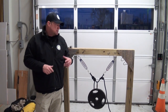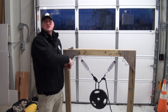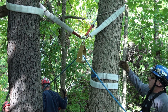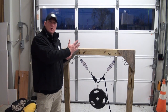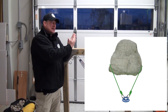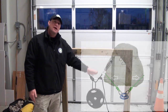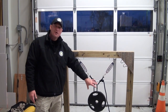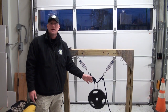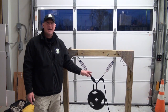In these segments we're going to go into some issues that revolve around angles - the critical angle consideration when working with anchor straps or any element coming around an anchor from two anchors. In those applications we're looking at an interior angle between those connecting points, so we want to keep that angle narrow. As that angle opens up, the element going around the anchors develops force multiplication, so each leg of the anchoring system can start carrying in excess of what the load is, very quickly overloading the overall system.